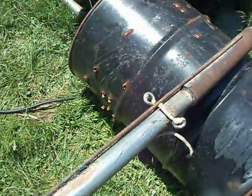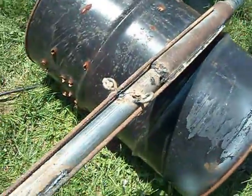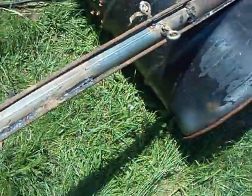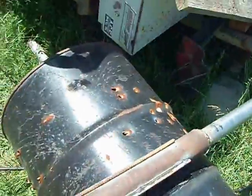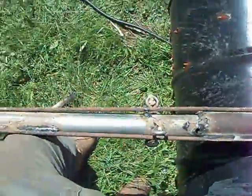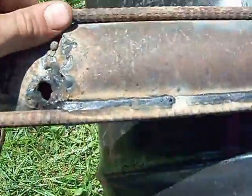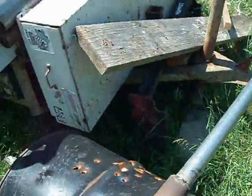Also, to add more support at the 30-foot mark, at the collars I'm taking rebar and welding it up. It's only 3-foot rebar — about a foot on the collar and about 2 feet on the EMT pipe — welded to the collar. And there are the other eye bolts.